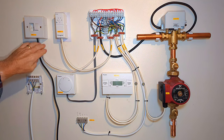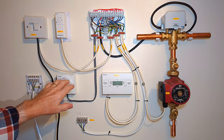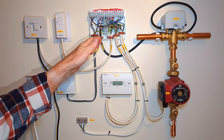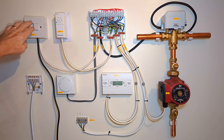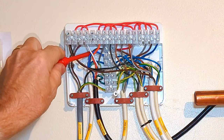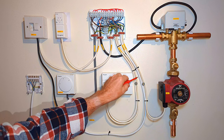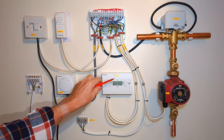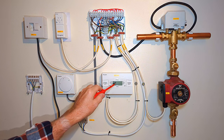Let's follow the wiring through so you can understand what we're trying to do. Here's the mains power coming into the system - it comes into the wiring center where that power is divided around the components. I always like to think of electrical wiring as being like a piece of string: electricity comes in one end, goes along it, and comes out the other end. If that string gets cut anywhere it stops the flow of electricity. We have a live wire coming in, going into the wiring center's live terminal, then coming out and down into the programmer, which also needs a neutral to run.